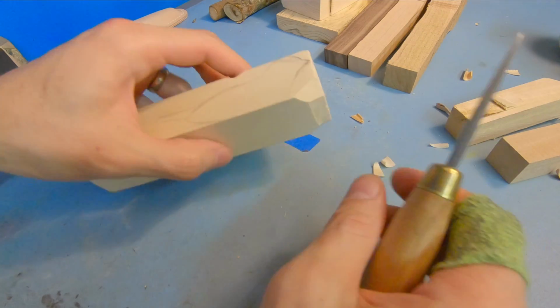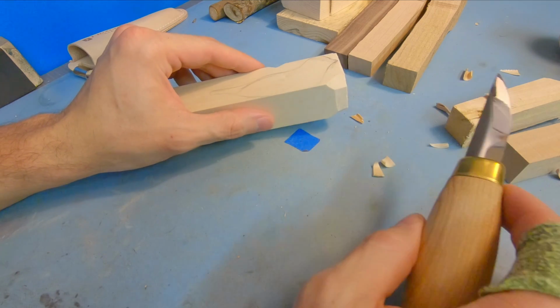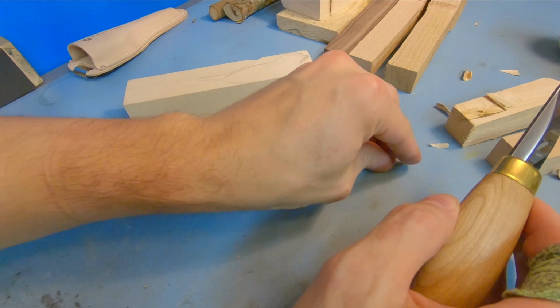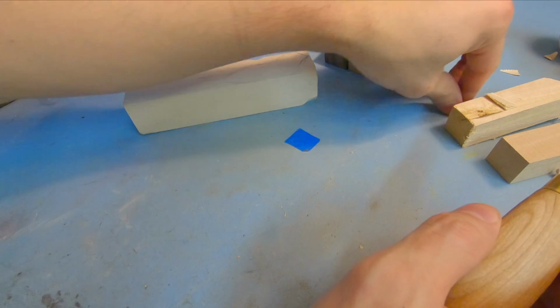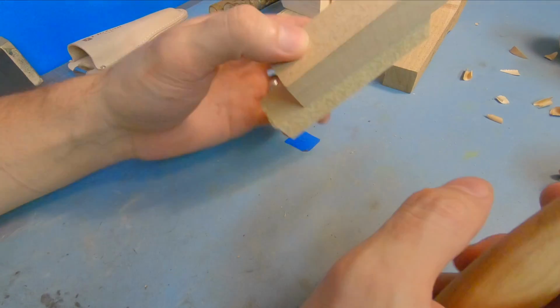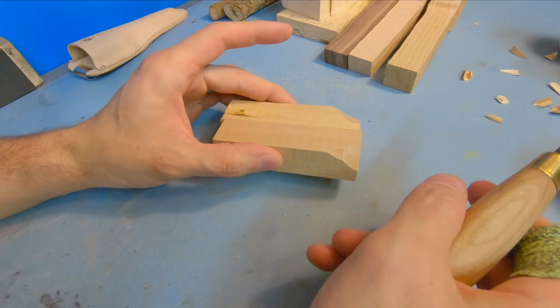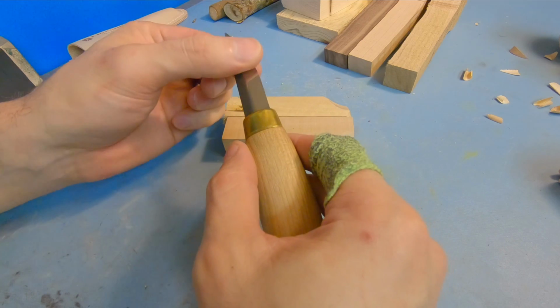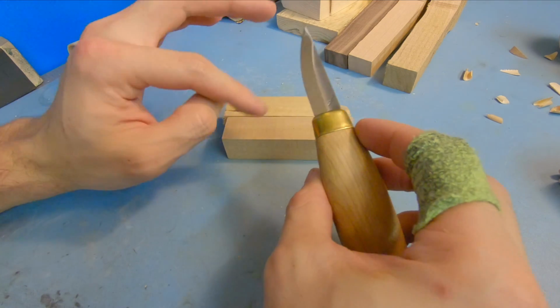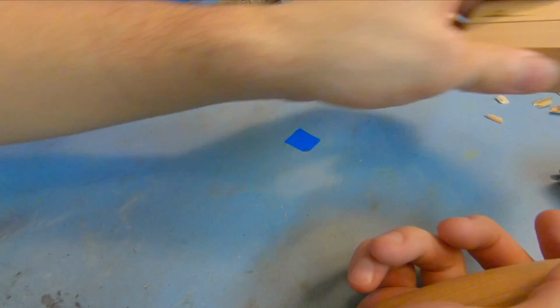But yeah, if you're going to get basswood, higher priority to air dried versus kiln dried. You'll have a much easier time whittling for the first time if you go that way. Air dried will be harder to find because most places I see are selling kiln dried because it's a faster process to finish up the wood and dry it up for use.